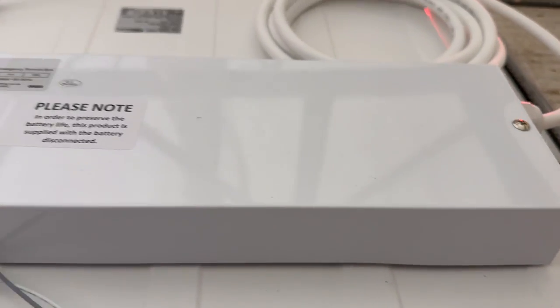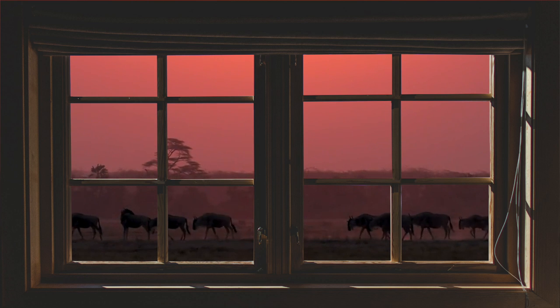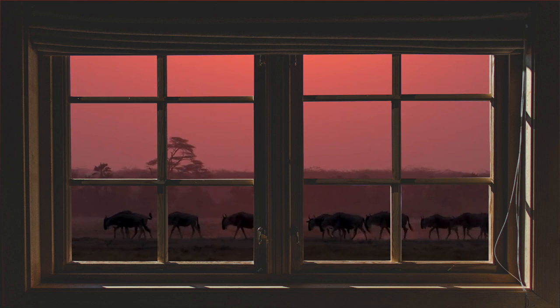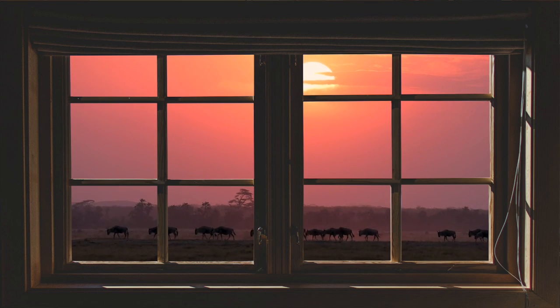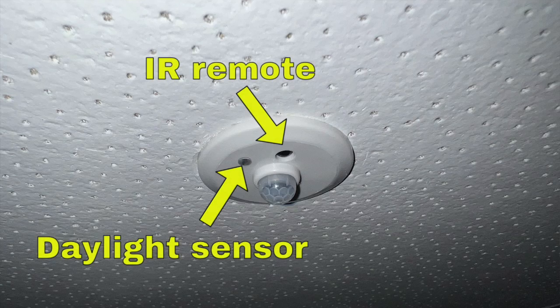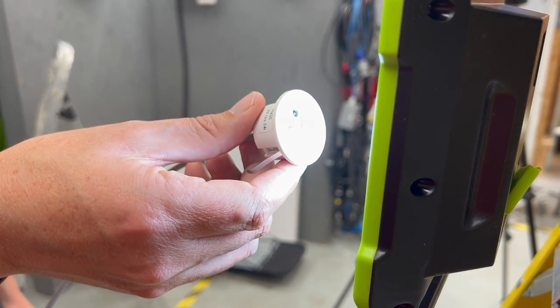Now at this stage, I want you to use your imagination and stick with me on this one. Pretend this side has windows, and outside a herd of wildebeest are majestically sweeping across the Skipton Riviera. The sunlight is beating through the window. Next to our imaginary windows, we've positioned all of our DALI dimmed fixtures in one row alongside a daylight sensor plugged into our control system. I'm going to use this torch to simulate all that fantastic daylight coming through the window, and as the light level falling on the sensor increases, we start to see the LED panels dimming.